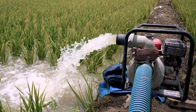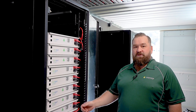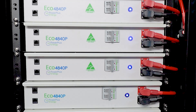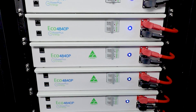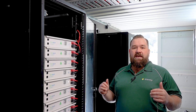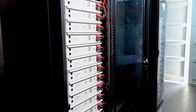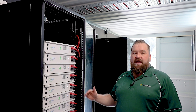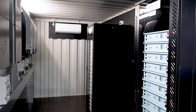Here we've gone with Australian-made Power Plus Energy batteries, specifically the Eco 4840 — a four kilowatt-hour battery — and we have 144 kilowatt-hours available to us. This site has generally a 100 kilowatt-hour base load between freezers, pumps, air cons, and general living. So to make sure we had good coverage on this site, we've gone with a large battery system.